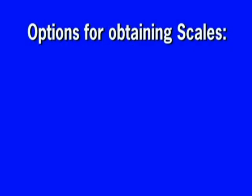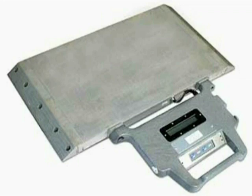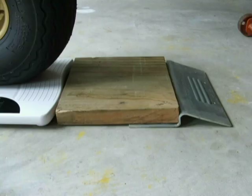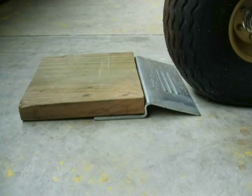What are our options in getting your home built weight? Where do you get three scales that can handle the weight of your aircraft? You could purchase or try to rent aircraft scales made for this purpose, but these are quite expensive. A possible better method is to create a ramp device that allows easy rolling of the aircraft onto the scale. These need to be replicated for each wheel so that the aircraft remains perfectly level when obtaining each weight reading.